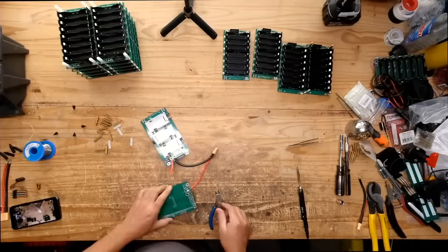So what happens is that if you were to plug a brand new battery in there, or your external battery, when the unit's off, then you would get a spark, which I actually did. Because then you basically have to pre-charge the bank of capacitors. So in order to get around that, you turn the unit on, which then pre-charges the bank of capacitors.